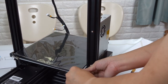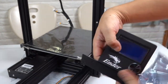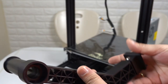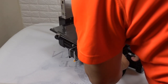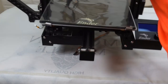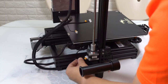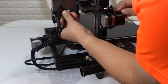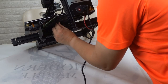The installation method is a bit like the Ender 3 Pro. The control panel is 90% similar to the Ender 3 Pro, and the installation method is the same. The only difference from all previous models is this consumable mounting bracket — it doesn't require screws to install. You just need to plug this hook into the body. After hooking it up, the bracket can be folded up. For the hot bed, the Ender 3 Max also uses a piece of glass. The wiring is exactly the same as the previous model — just correspond to the letters X, Y, Z, and E. Distinguish the wider plug for the motor and the narrower plug for the limiter and there will be no problem. Then connect the output and input of the transformer.